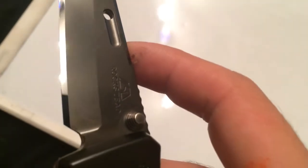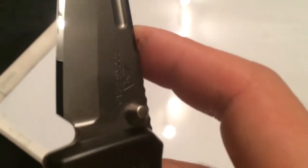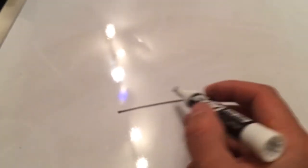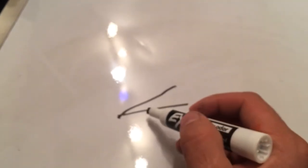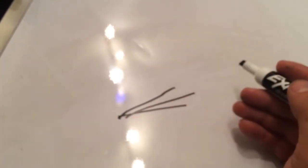Here you got a Shinogi-Zukuri, which has two different bevels. You can see them right there. These do not go from 30 inclusive to 24 inclusive like the Hanzukuri, which I know because you can see that this bevel right here does not change shape from going there to the tip, because if it did change shape, down here it wouldn't be as wide as up here at the tip. What I mean by that is, say here is 30 inclusive, here would be 24. So you'd have a much steeper tip right there.